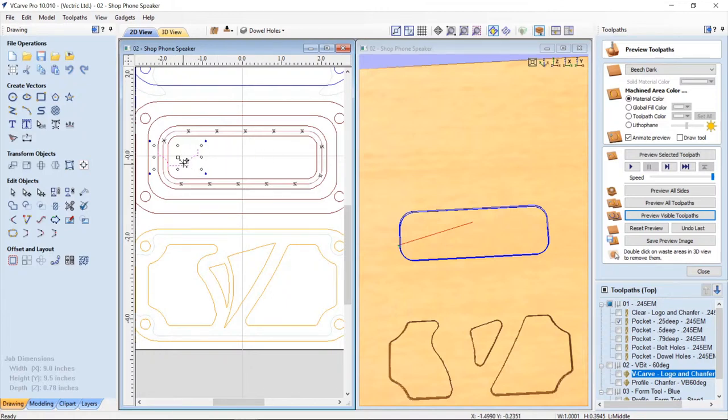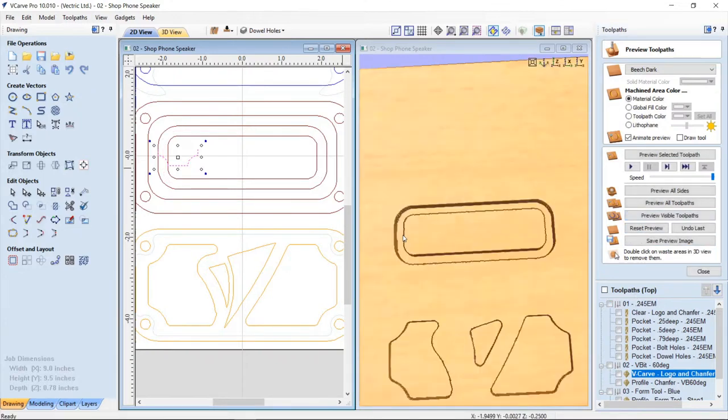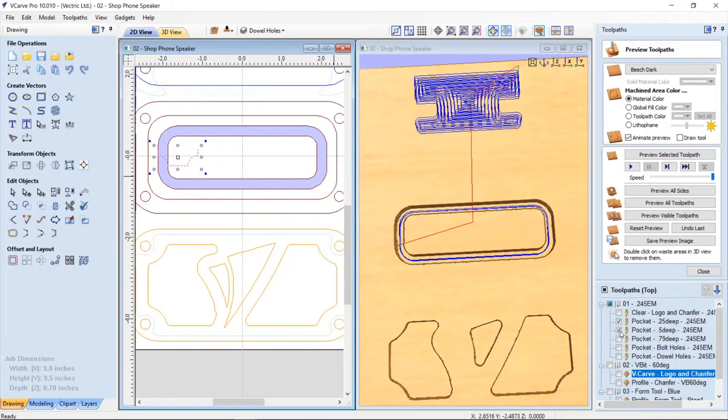And that was important, because when the CNC machine moves this over and it plunges down, there's nothing at the bottom of this to remove any material. So I had to make sure that material was missing. And you'll see that the first step is right here. So let's preview that. You'll see that it actually removed that. And if I take a look at the solid preview of that particular toolpath, you'll see that it's actually removing that there. Let's preview the next one,